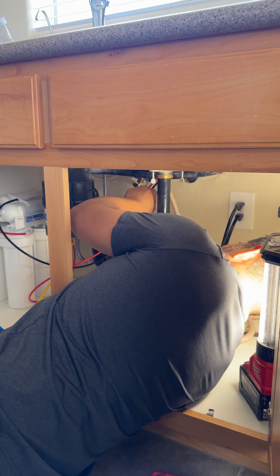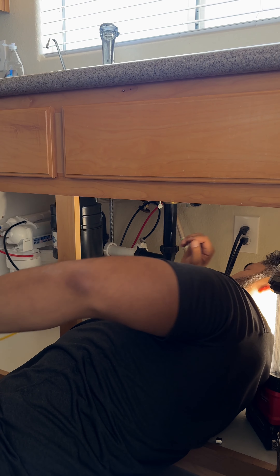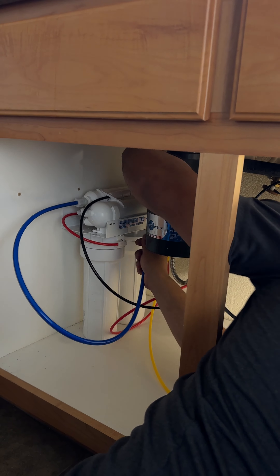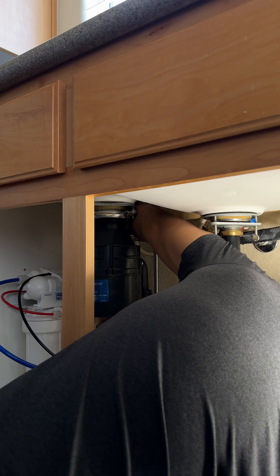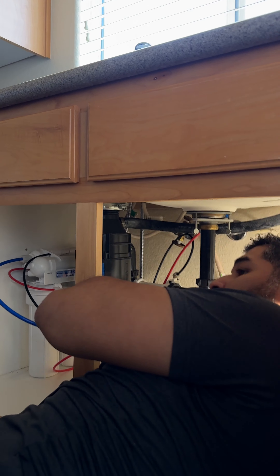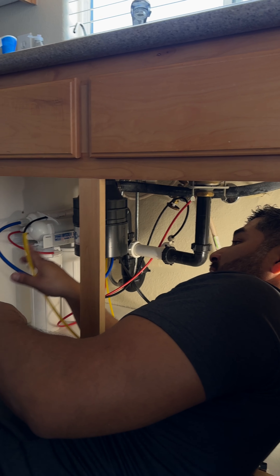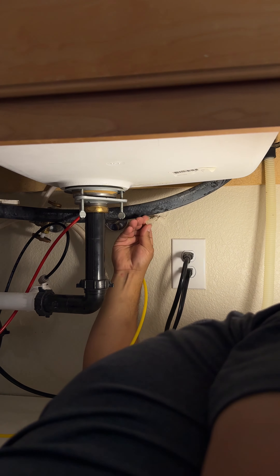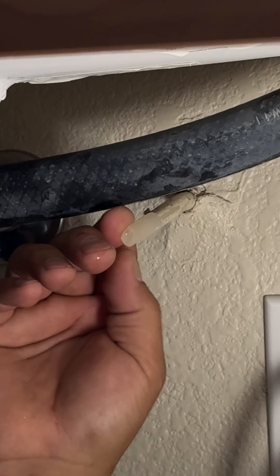Here we go. Black is for waste water. Red is for water feed. The blue is for supplying the water to the reverse osmosis faucet for dispensing purposes. And the yellow one, we're going to have this one ready for the tank. In this case, we are also going to tee off the water supply to the kitchen supply line here — this is for the fridge. This will supply water to the fridge to make for dispensing the ice and the water.